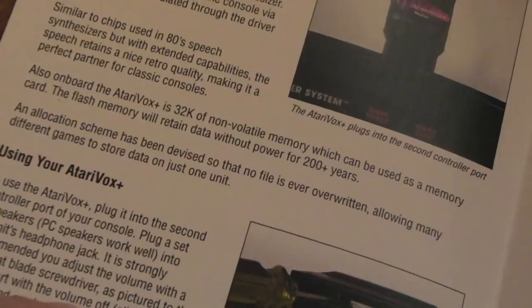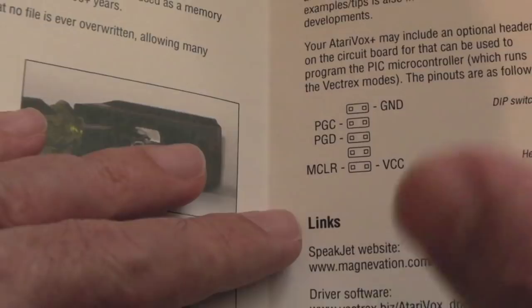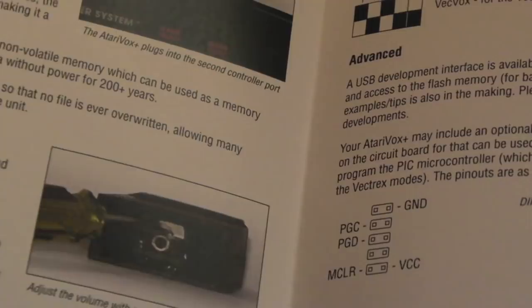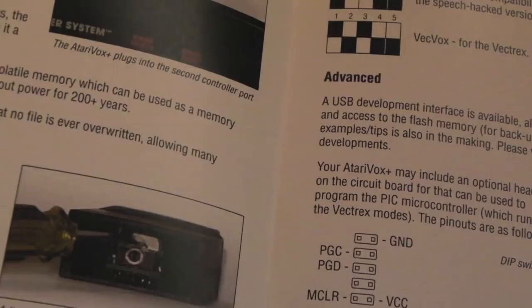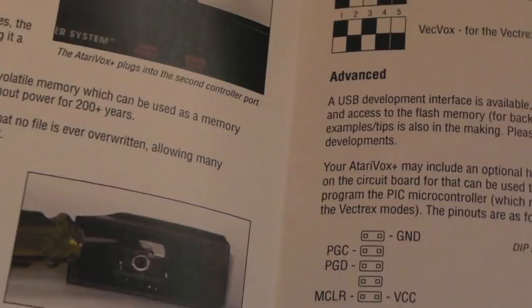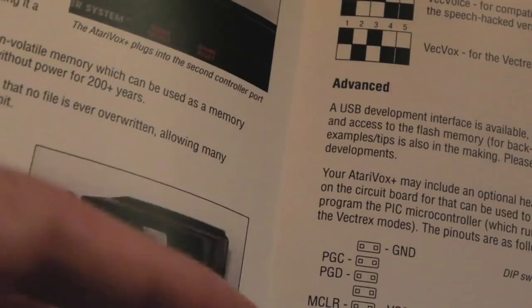The last time I did anything with serial — well, about a year or two back I took one of those little USB MAX232 adapters and connected to a ComLynx cable. I wrote a client to program the Lynx flash card from Lynx Man. I don't think it's applicable to the current model because the firmware and command protocol changed, but it works with mine. I also did the whole ComLynx to MAX232 thing to connect my PC up to the Lynx and download software onto it.